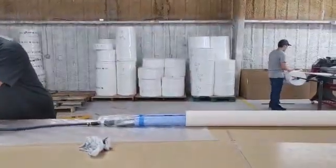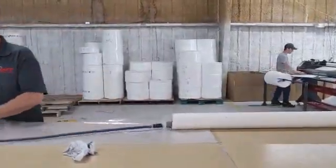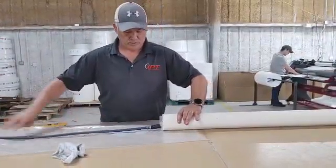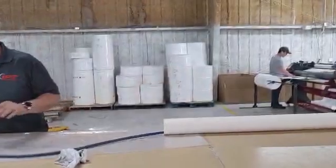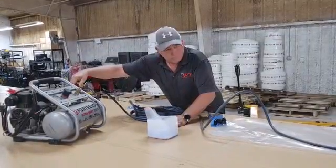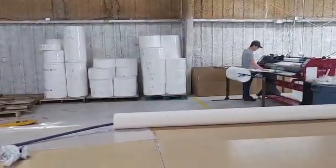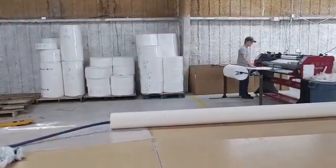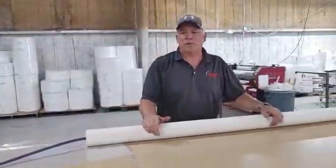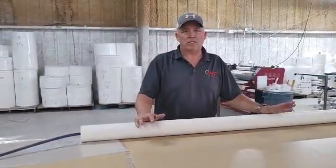You can see a three-inch line — very easy to go through, lots of space and room. Once we get it into place, we can push this quite a ways even with just a normal air hose. We have rigid air hoses available. Once in place, you can hear the tape popping, so the guys know we're fully inflated. We can gauge anywhere from a 30-minute cure out to an hour cure. We also have small mini steamers that give the guys time to get it into place and then cure it in about half an hour.